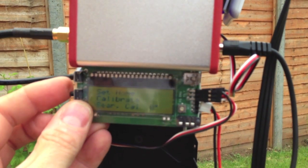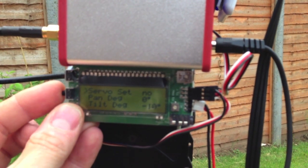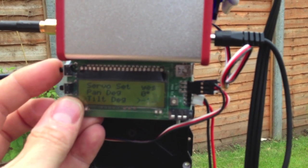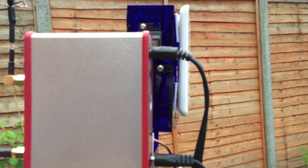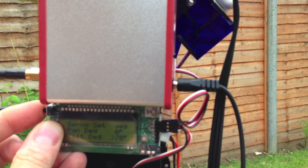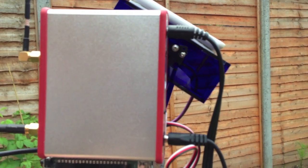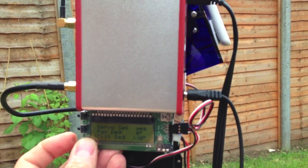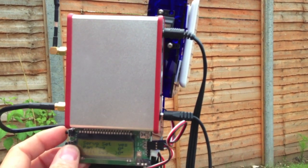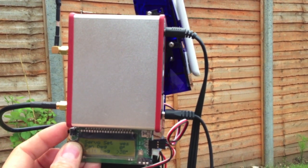To manually check it, where it says servo set, you can have that on no or yes. We've currently got it on yes so we can test things. At the moment tilt degrees is minus ten, so I build that up and I can see that it is moving up. So if we get it to 90 degrees, you can actually see that it's not gone full 90 degrees. If we go back down to zero — zero is there, it's not quite pointing level, but zero is there. If we go up to 90 from that point it should move 90 degrees, but as you can see it's not.